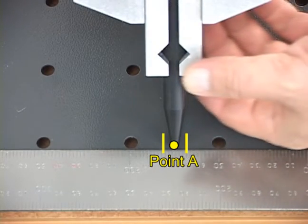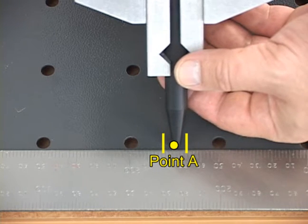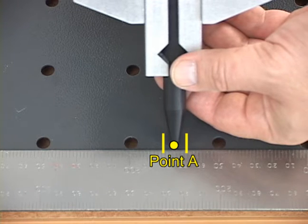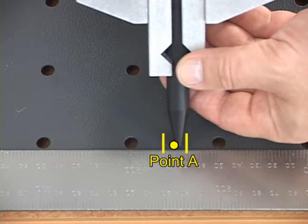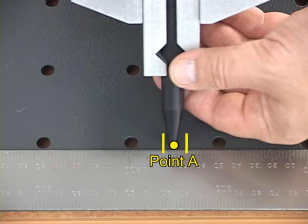This gap is due to the backlash of the gearbox of the control motor. Use the graduations on the carpenter square to verify this. Fine tune the rotation of the robot base if necessary until both gaps are equal. If in a later step the base articulation is moved inadvertently, you will have to repeat the calibration procedure beginning at the start of this step.